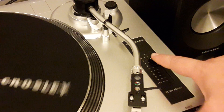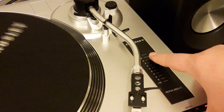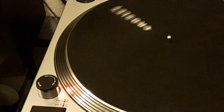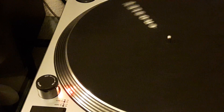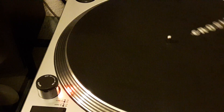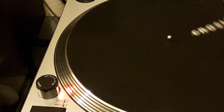So if you look over here, this record player has a pitch control, which is basically a speed control for the turntable. I need to adjust this while looking at those dots. We're going to adjust it until we get it — there, you can see it goes too fast, we need to get it still. I've got it at about three right now. And it's creeping back down so it's a little bit too much, but it's close. They should be pretty much stationary — that's pretty good. Even if they're marching in teensy-weensy bits one way or another, it's close enough.